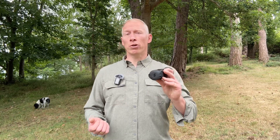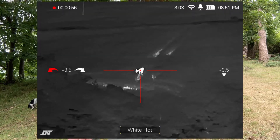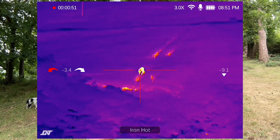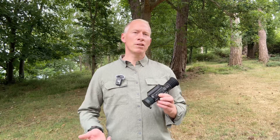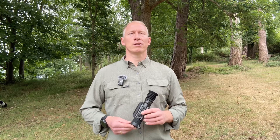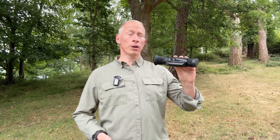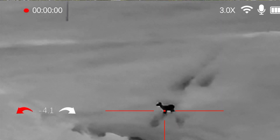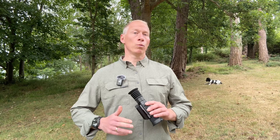Thermal palettes. When scanning terrain you may find different thermal palettes are more effective. When the device is switched on, you can change the palette with a short press on the menu button. You can select between white hot, black hot, red hot, and iron hot. Screen brightness can be adjusted with a long press of the zoom button — a brighter image may be useful in the day, but you'll probably want a lower setting at night. You can also set the Hydra to record the screen by pressing the record button with a long press. You'll see a red recording icon and a timer in the top left of the screen; pressing the record button a second time will stop the recording.